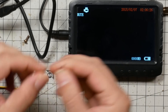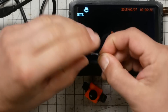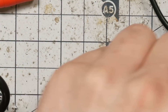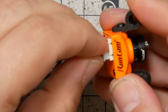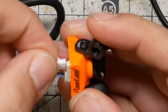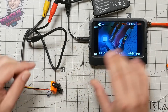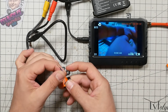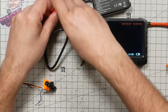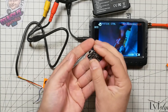I found a wire right here on my desk. I'm going to strip it, twist the two ends together, unplug the battery, then plug in the twisted adapter so that those two pins are shorted, and plug in the power. When it powers up you'll see it says 'UART control' in the upper left — that's telling you it will now be controllable by your UART. If you need to go back, just bridge the pins again and power up; if it says 'joystick control' that means it can be controlled by the joystick.